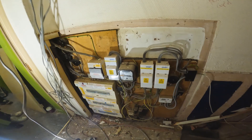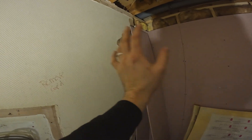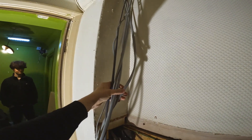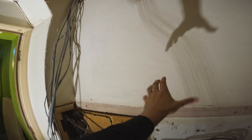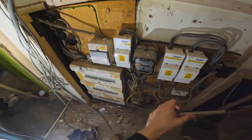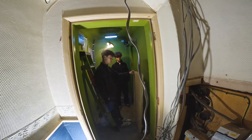As you can see, it's a right little mess - we're basically polishing a turd on this job. All the cables are gonna come down here. Phase two will have hotel room after hotel room with loads of ovens and appliances - we're gonna power those up. All the cables are gonna come through along down through that section. We've already got four cables in for some other rooms. If we get some big 150 by 150 trunking coming down across, we can fit that fuse board onto there and the tails could route through up into the bottom of it.